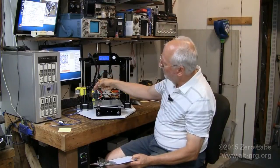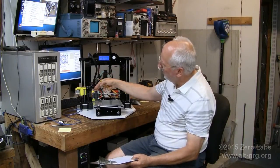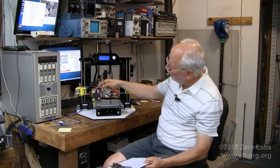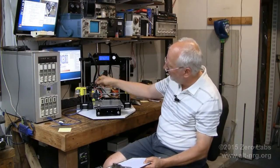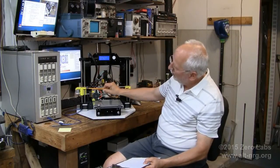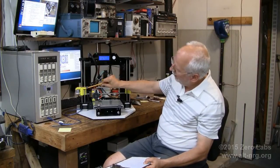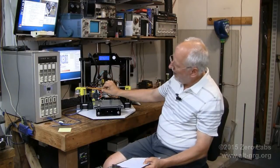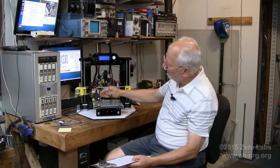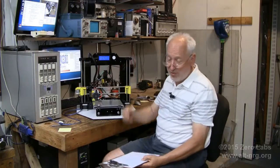The nozzle assembly bolting to the face of the stepper motor does not provide a flat surface, so when you screw it to the J-bracket for the X gantry, the stepper motor assembly sat crooked. I had to shim the bottom of that aluminum block with about four or five layers of Kapton tape in order to get the whole assembly to sit horizontal on the gantry when you tightened the screws down.